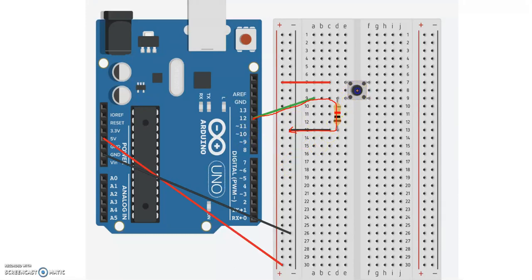When the switch is pressed, I pressed on this switch. From this switch wire, I come to this point, go through the switch, and then go out here, and I see the logic high. Okay, so that's how it's wired. So this switch is wired up so that when I don't press it, I get a logic low. When I press it, I get a logic high.